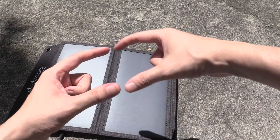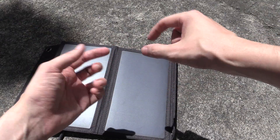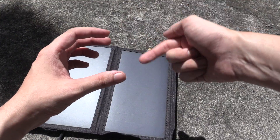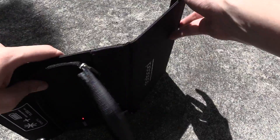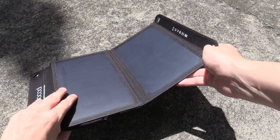In the past people have asked me about small power banks with built-in solar panels and I've always said they're a waste of money, because the solar panel is normally like one watt at most and there's no separation between the heat from the battery and the sun. At least with this one you've got the panels and some extra fabric that keeps the sun away from the batteries, so I think it should be fine putting this out in the sun and leaving it to charge.